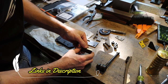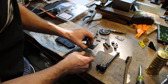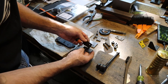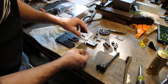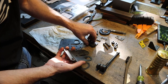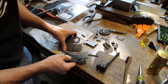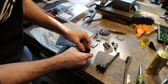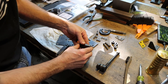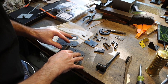If we ever had to grind them again, we'd have to just dust them. So we'll keep them sharp and then we won't have any trouble. When you let them continue to wear and roll over them edges is when you get problems. So this also needs to be really straight because this is what holds those blades. And if it's bent any bit, or if the bolts that hold these two frames together are loose, it allows these blades to separate a bit and it more tears the blade that you're cutting into instead of shearing it. So you need to make sure that this fits together properly.